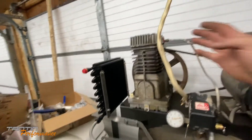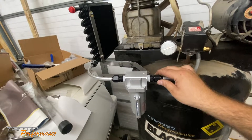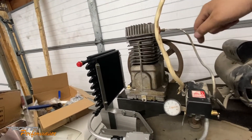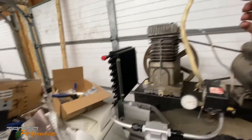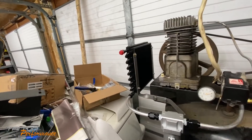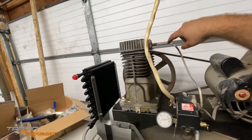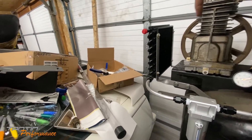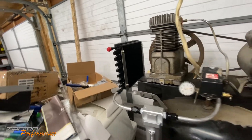I've got to go get that fitting, another nut and ferrule. I'll put that fitting in, then build that bend on the line - get it bent, cut, and flared. I can't flare this end first; I have to flare the other end, get it bent and cut, then get the ferrule and nut and bend that end. I think it's going to come out with a nice bend here, come out, kind of come up, then bend back down in there - just a nice swoop.